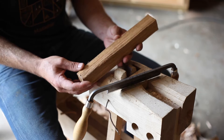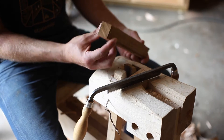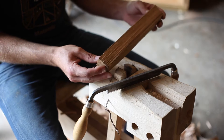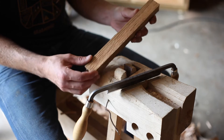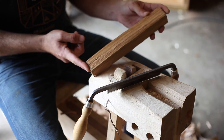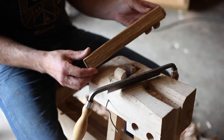This is a piece of green red oak, just split right out of the log, and we've split it down to just a little bit over an inch by an inch. You could use any hardwood — you just need it to be harder than the pine, which is what the beams are made out of. This piece is about 11 inches long, and our beams are only 6 inches, so we're going to have a little bit of excess to work with.